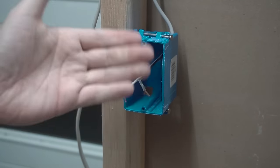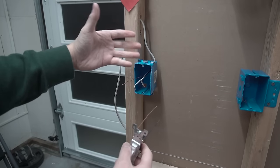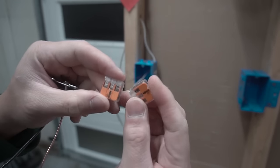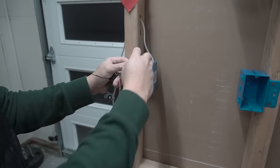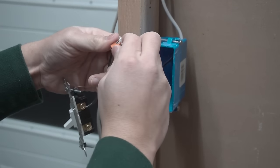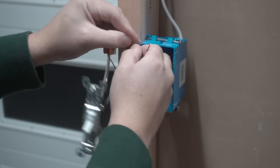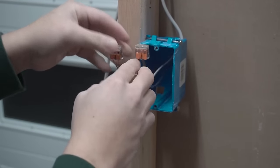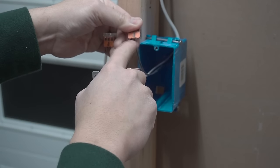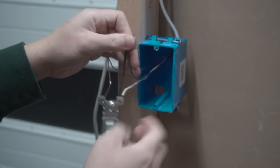I like to go step by step and not introduce too much wiring at once so you don't get confused. Use two pieces of three-lever Wago connectors. Put one Wago into your ground and connect the Wago through there. Then take your other three-lever Wago, open up two levers, put your hot wire in there and connect the hot wire with the other hot wire. Make sure when putting in the Wago wires there is no exposed wiring on the bottom, and make sure the wires are pushed all the way to the top — you can see it through the window that the conductors are touching. You're going to leave the white wire open — these two slots are open for other wires that will be joining there.